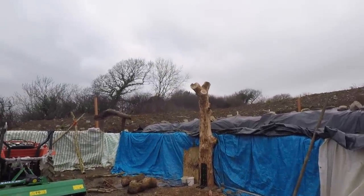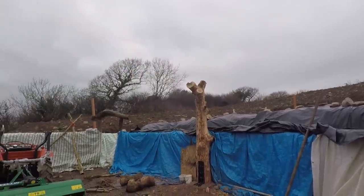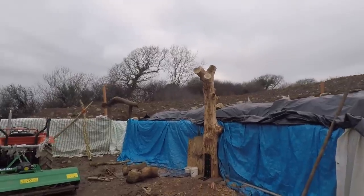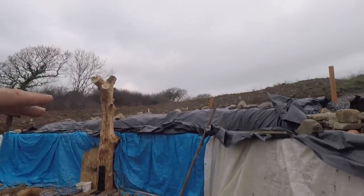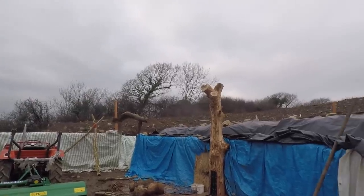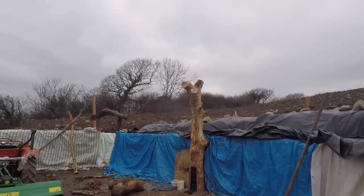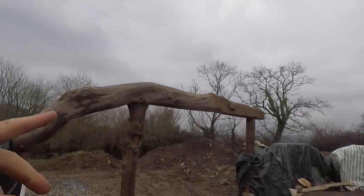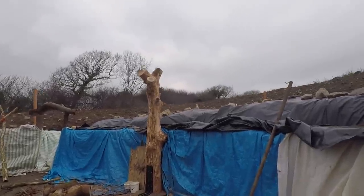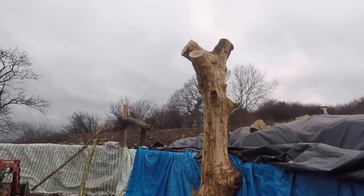And so, first log rests in that crutch there, and then it spirals around. It's a very shallow pitched roof, because otherwise when you're in the top workshop you won't be able to see over the roof. The roof will obstruct the window, so it's a very shallow pitch. It's only about 450 millimeters of fall from there to there, but it will work, it will drain. But yeah, very pleased, love the shape of the log, very glad I picked that one.